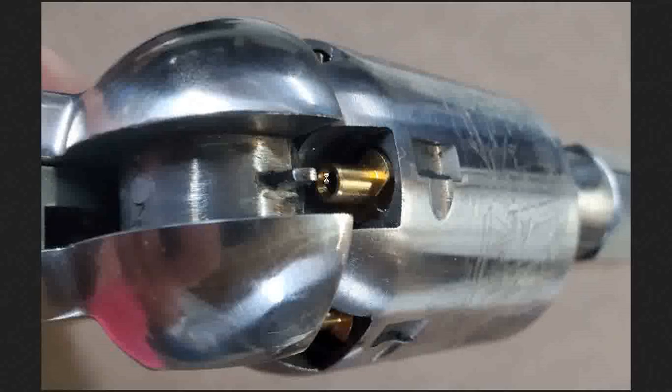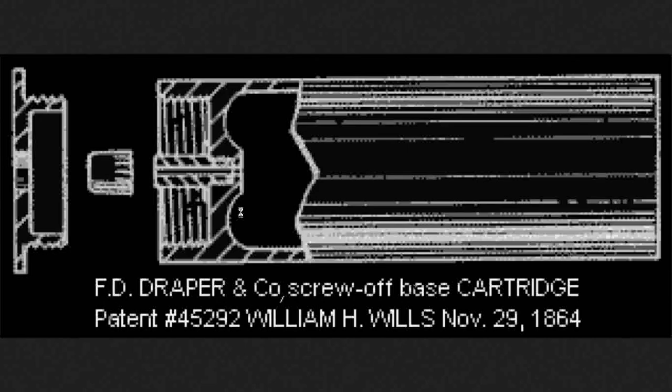Now, let's move forward. Again, the previous method was this, where everything's centered, just like this, but it used a simple cap like this that was just, let's say, twice as tall as this, for instance. Here's a design where someone took the tube or nipple from the back of, let's say, a muzzle loader or a cap and ball revolver, integrated it into a metal tube to act like the chamber of one of 6 in a revolver. This would just be 1. And then they made it to where you could take the same percussion cap and stick it onto there. And then they made it to where this would go onto it. Other methods were used for closing up the end, where it would press it shut and keep it from being able to move, keep it reasonably waterproof, that sort of thing.